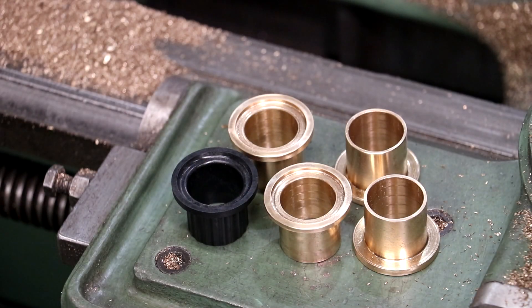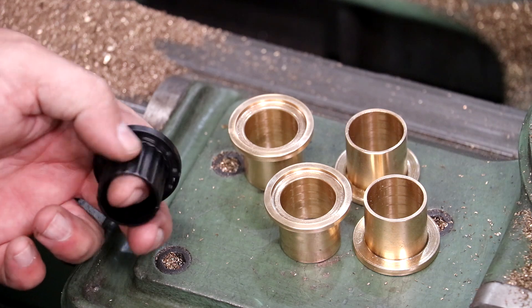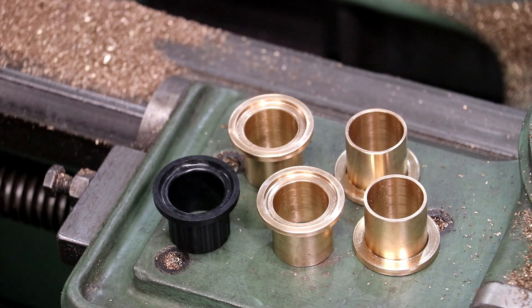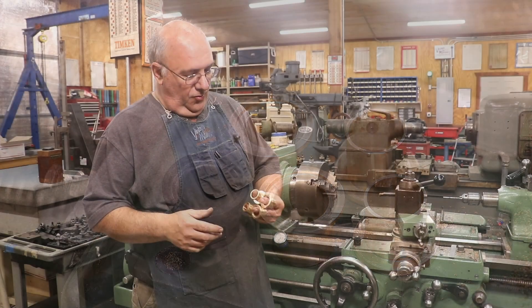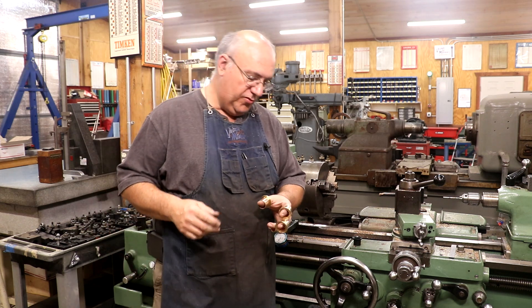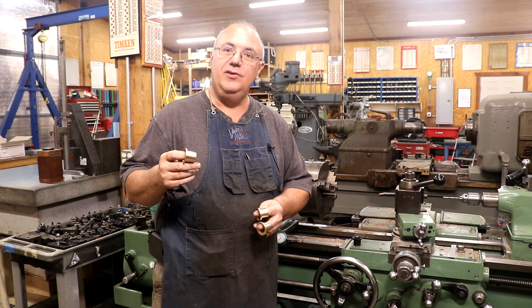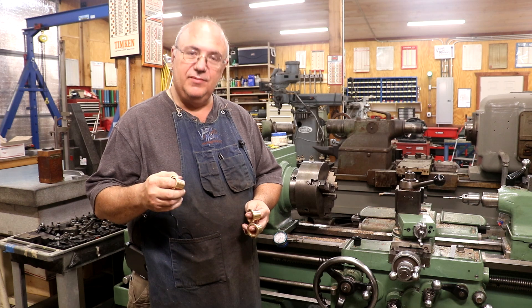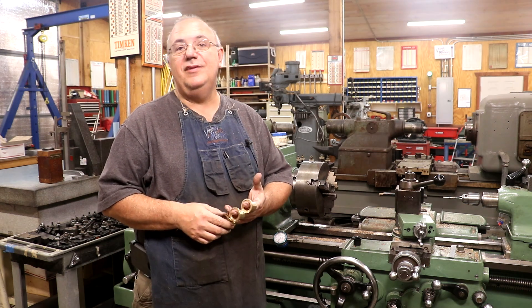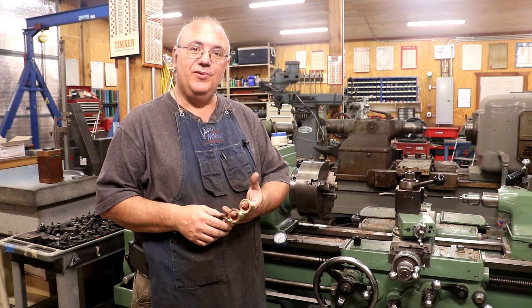Just like that, I think we got this project done. We made four new bronze bushings to replace these plastic ones. I don't have the little scallops on there, but it's just going to fit down in a hole so it's not going to matter. I think these will hopefully last longer than the plastic ones. Hope you enjoyed that — a little quick project here on the metal lathe making bronze bushings. I've made a million of them over the years for different applications. The nice thing about them is they're easy to replace: just knock out the old ones, put in new ones. Hopefully these will hold up better than the plastic ones he was using previously. That's going to be a wrap — please subscribe to the channel if you haven't already. Thumbs up and comments are appreciated, and we'll catch you on the next video.